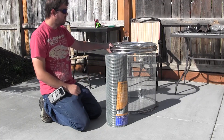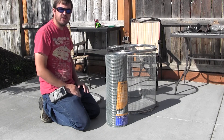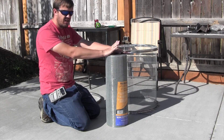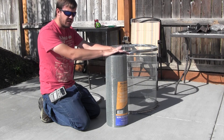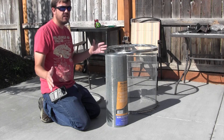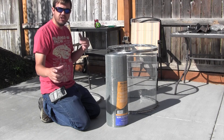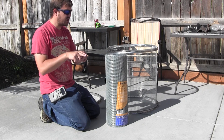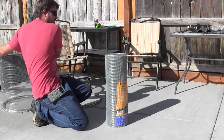We've got our hardware screen, and we've built up one of the trommel sections. We need to build up the other section and attach the two together. We figure it's right around 66.75 inches of length, or 170 centimeters. We're going to add just a couple of inches — about 5 centimeters — to the length as an overlap on the screen. So let's get measuring and cutting.